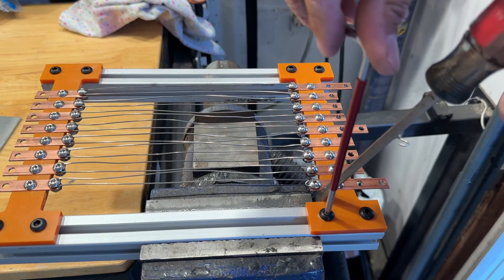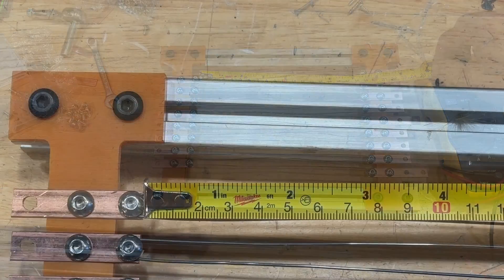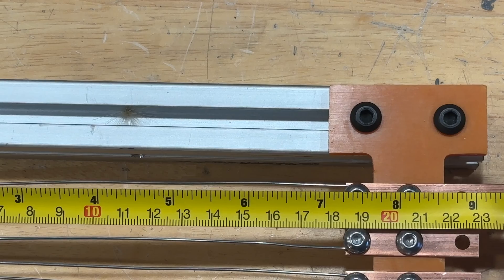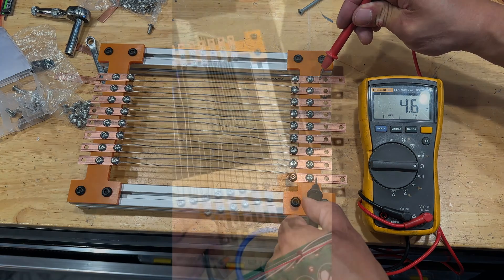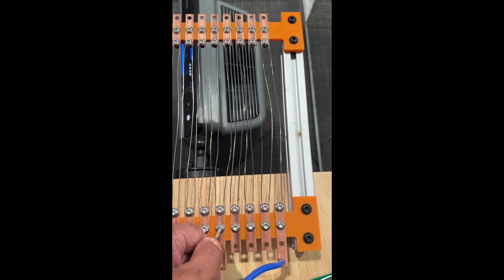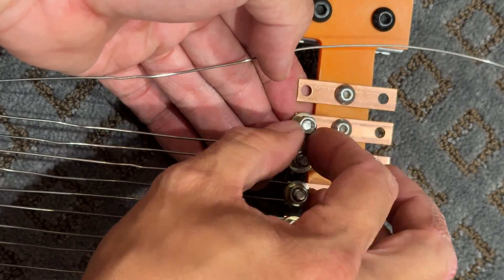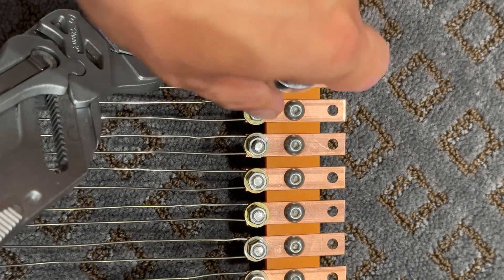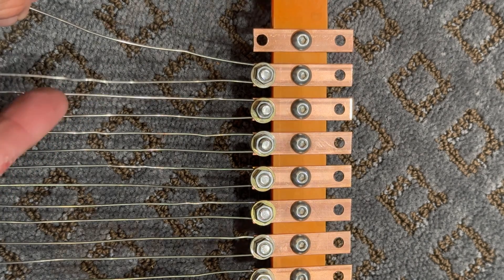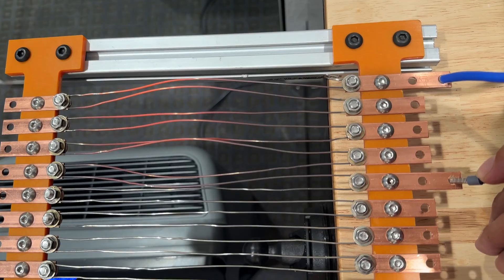This was my first attempt at lacing up the nichrome wire — it was a little loose. Here I'm checking the length; it's supposed to be 7 inches. The resistance of my meter leads is about 0.5 ohms, so measuring 4.6 means it's really about 4.1 ohms. This is my first attempt at applying power to the resistor. I didn't realize how much longer the wires were going to grow once it got hot, so I decided to relace them with a little more tension. I found this wiggle technique helps get the slack out. The wires look much cleaner now, but as soon as I put power through, everything got stretched out again anyway.